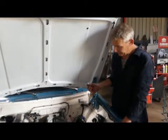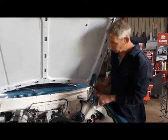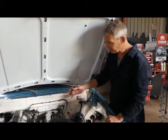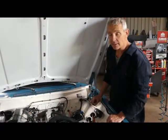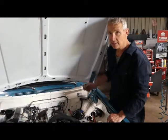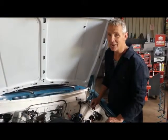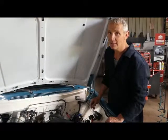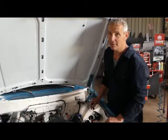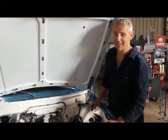So we've done the lower wishbones, we've done the cross member, and we've made sure that the front bulkhead and front longitudinals are all tied in nicely. The only thing that remains is to tie the roll cage into the shell at the top of the posts, and then you're going to have a really good long-distance tough rally car — good for the Preston, or indeed the London to Cape Town or Peking to Paris. That's all you need to do to strengthen the car. Thank you.